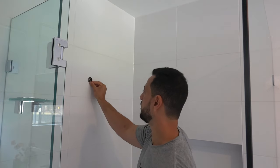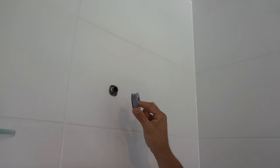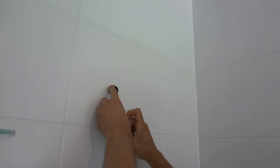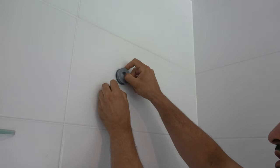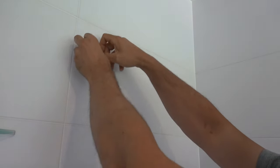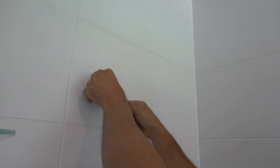We're also going to clean off the old plumber's tape and install some new Teflon tape. Always make sure that you go in a clockwise direction because your new fitting will also go in a clockwise direction. Get that first initial bite by slightly tightening it on, then once it's got a grip just rotate it around — usually about 7 to 10 times is sufficient.